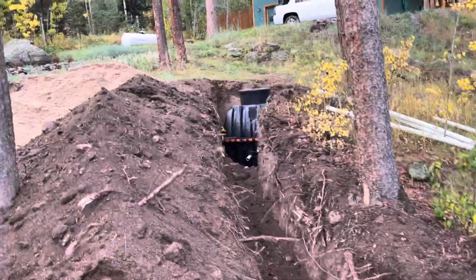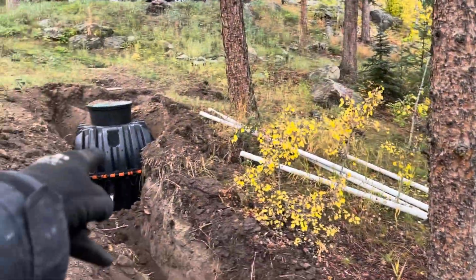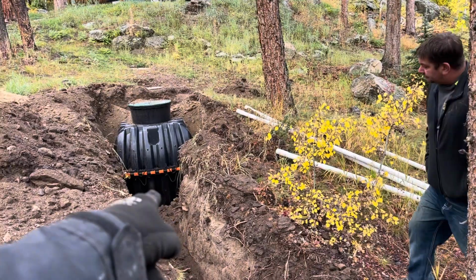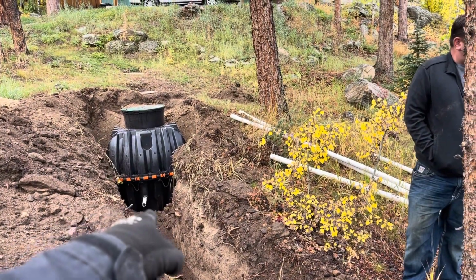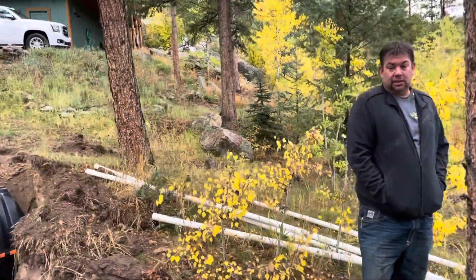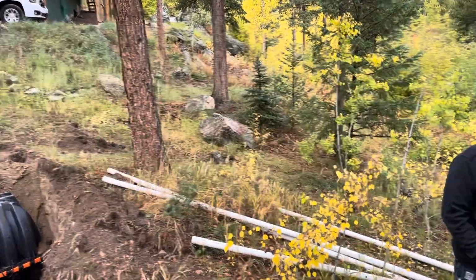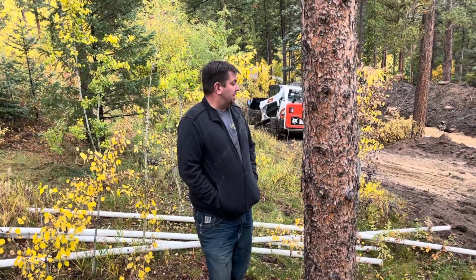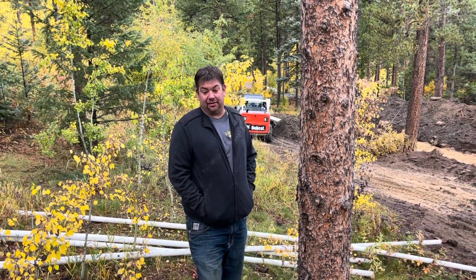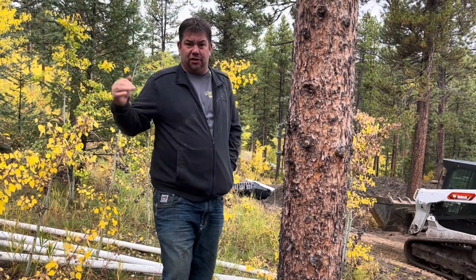And then the other thing is, the counties don't always like you to use these dosing siphons, and they want to make sure that you have plenty of fall from your dosing siphon, so that pipe's coming out of the bottom of the tank, so you're losing an amount of fall there. But you want to have basically 6 feet of head pressure in your drop. Now the guy who makes these, he says you don't need any, but that's where the engineers in the county like to see that. You still do an old style gravity system if you have a 6-foot separation of fall from your tank to there. If you have a 6 foot? 6 foot? Yeah. Then you run that through the dosing siphon